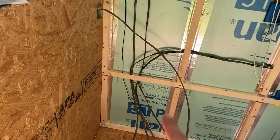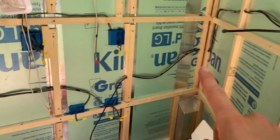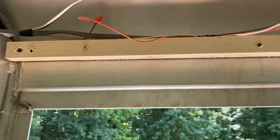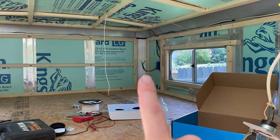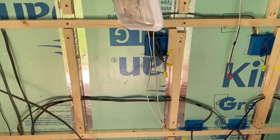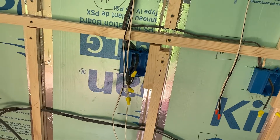As you can see, it goes up. My first outlet goes up over here and this is my first outlet right here, which is the fridge. From the fridge I take that wire and went all the way over here, fed it through the walls — and this is going to be the outlet for the TV. After that it's fed up through the wall all the way over to a outlet on the left-hand side of the bed, then one on the right-hand side of the bed, and then it goes back over and comes back down. This is going to be a normal outlet right here for the kitchen. Both of these two outlets are just regular outlets — they can plug a coffee maker in or whatever they want.